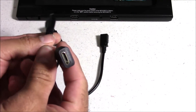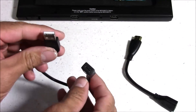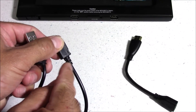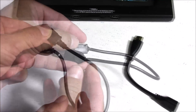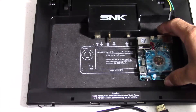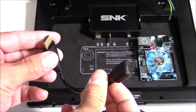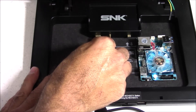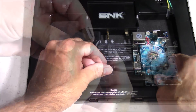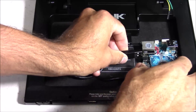Now it's time to get the XU4 inside the case and we're going to need a few adapters. You'll need a mini female HDMI to standard male adapter, and also a female micro USB to standard male USB adapter. For that cable it's a good idea to remove the sheathing on the ends using an exacto knife to save room inside the case. We'll start with the HDMI cable first — the mini end plugs into the case itself and the opposite end plugs into the Odroid XU4 board. Then plug in the female micro USB end to the case.